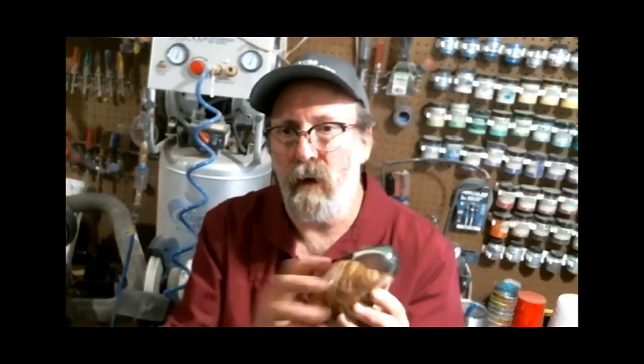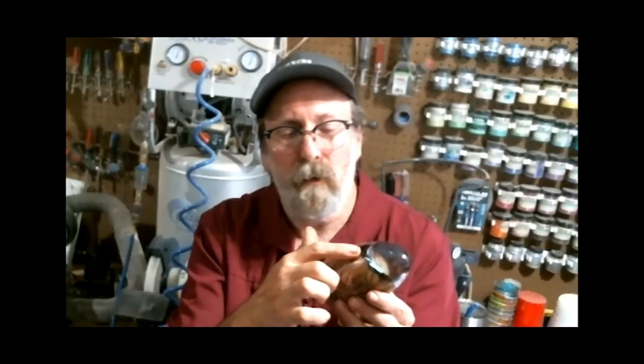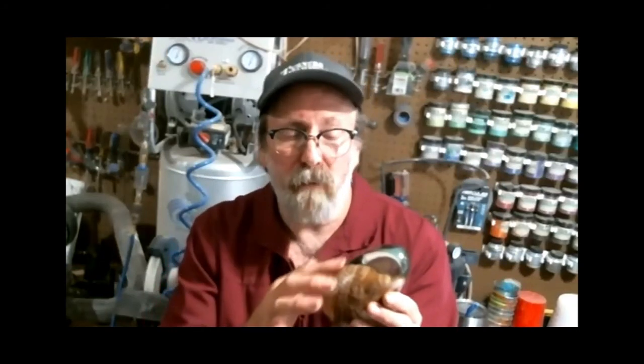If I take it from a dry climate to a humid climate, it's going to expand, and you'll actually feel that joint. You'll feel the burl line. And if I go to a dry climate, it's going to shrink, and then it's possible of cracking, and you're still going to feel that joint. Even though it's finished, it absorbs and it expands or contracts with the moisture from the air. So stabilizing it helps keep that from happening.